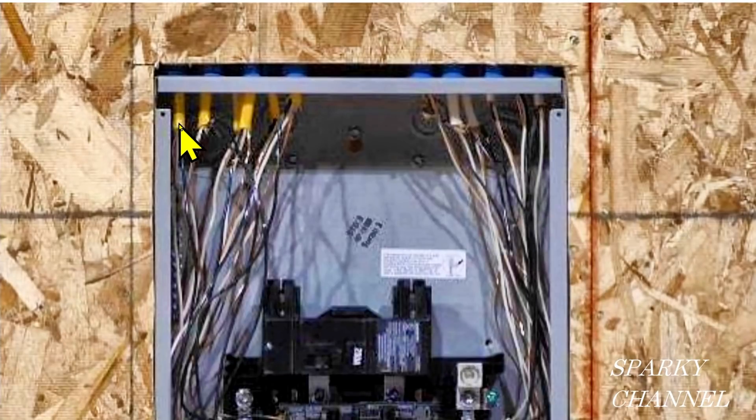This one's about an inch and a quarter, this one's about an inch and a quarter, this one's maybe three quarters of an inch, this one's about a quarter of an inch, this one doesn't come through at all. This one's maybe three sixteenths of an inch, this one has no sheathing and no fitting either, and this one's about five sixteenths of an inch. So what do you think — before we crack open the code book, do you think there are any code violations here?